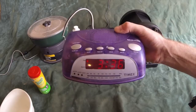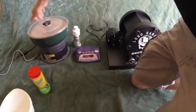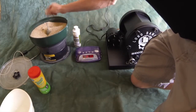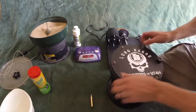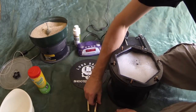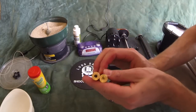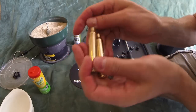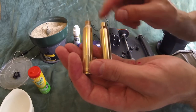Alright, as you can see, it's been about two hours almost exactly. So I'm going to pull a couple of samples out and compare the results — two hours of tumbling in corncob media versus STM. So there's the corncob, and those are two samples. Take a look at the results. This is the corncob, and that is the stainless tumbling media. As you can see, there's a big difference. Not so much on the outside, however — this one is still showing some marks from inside the chamber, but this one is not showing any at all.